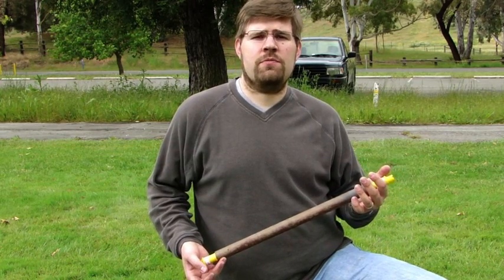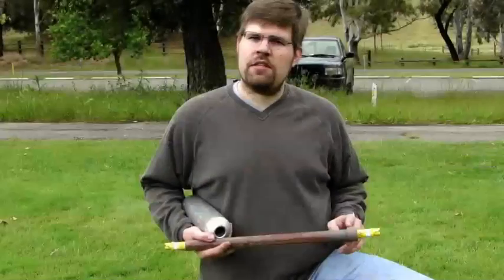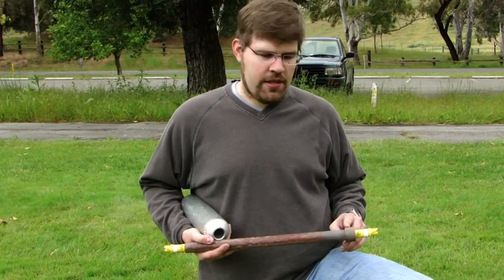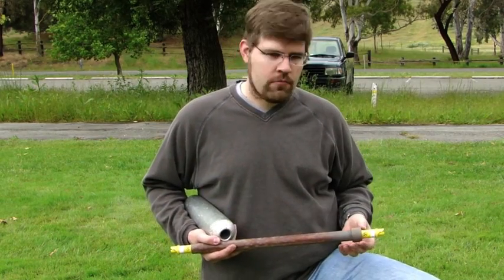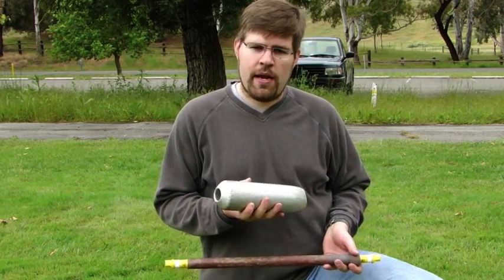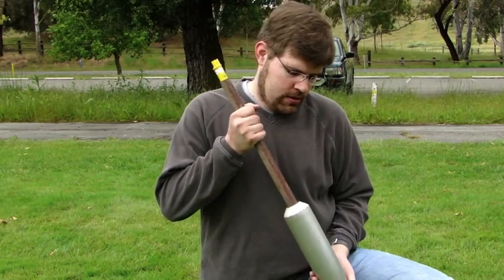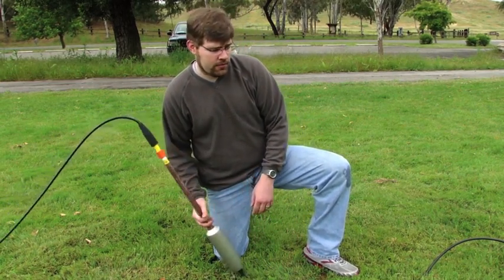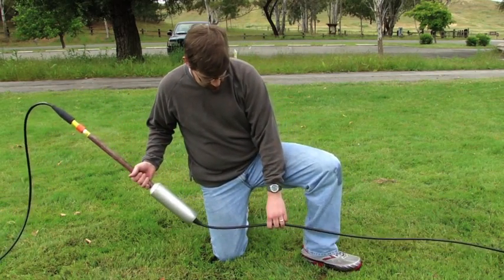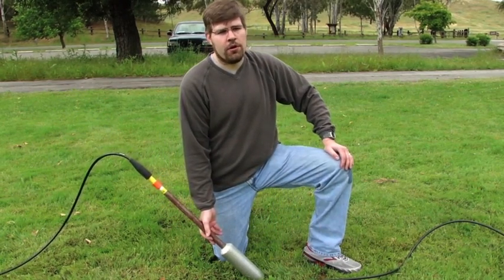This in my hands here is what we call the optical wand. It provides electrical isolation from the receivers to the console. There is a lip on one end of the optical wand — this end with the lip goes towards the receivers, and the end without the lip goes towards the console. The purpose of this lip is for the weight: it keeps the weight from sliding past the lip. We slide the weight down the wand and it stops at the lip. This weight helps keep the dipole cable on the ground, because a cable that's flapping or lifted off the ground will give you reduced data quality.